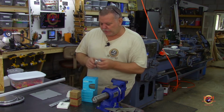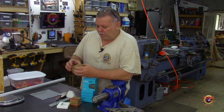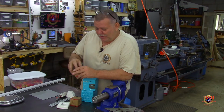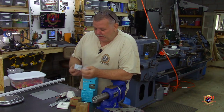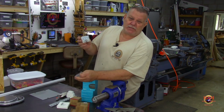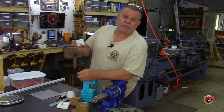And then while I was doing research, with everybody talking about lighting again on social media, I wondered how much it draws. So, of course, I looked on eBay and found amp meters. I bought 2 of them. I'm going to wire one in front of the relay to see how much the relay is actually drawing. And then I'm going to mount one behind the contactor to see how much the actual lights are drawing.